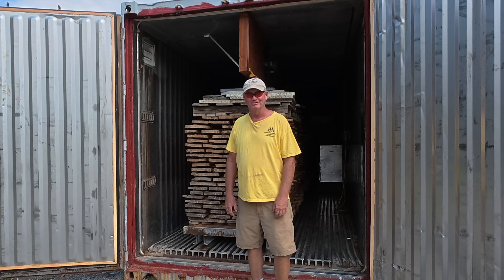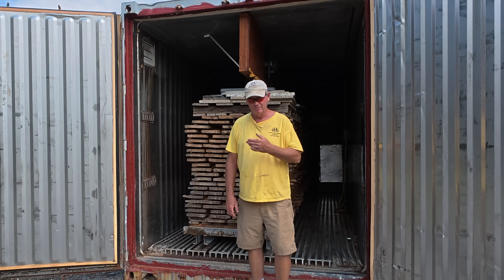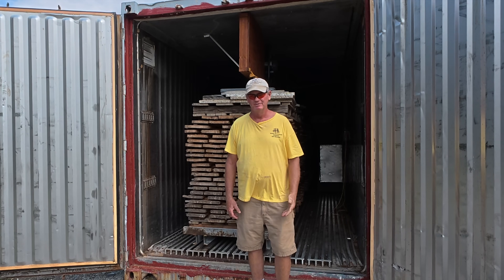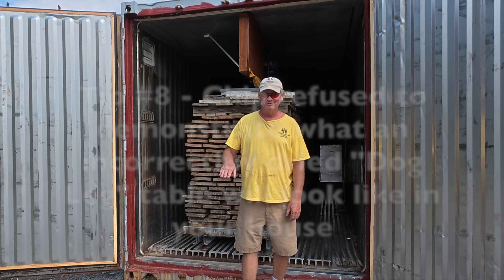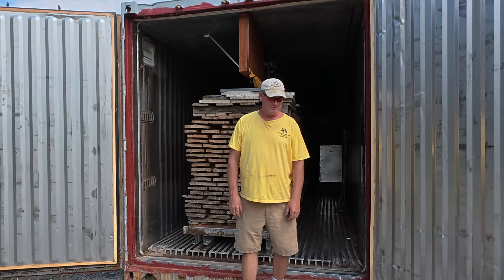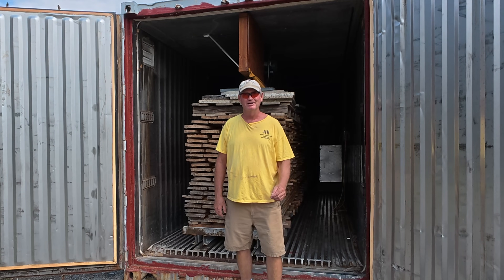The air conditions in the house cause the moisture to leave the wood at a rate faster than the maximum allowable moisture removal rate for that species and thickness. That's what causes cracking or furniture to move — what I like to call dog-legged pieces of furniture. You buy wood from somebody who's only got it air-dried, you work in your shop that's open to the environment — garage or basement — and then you build a table that sits perfectly flat on the floor, move it inside, and a week or two later one leg is lifted off the floor. Before long, that leg's going to be so high off the floor, it's going to be like a dog peeing.